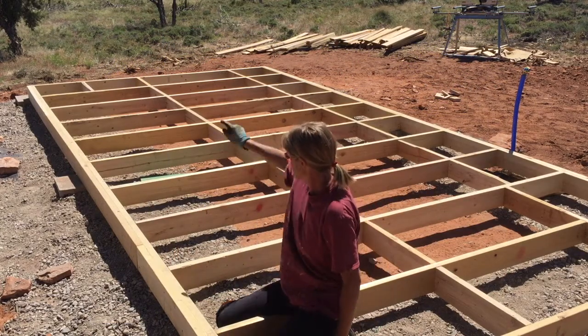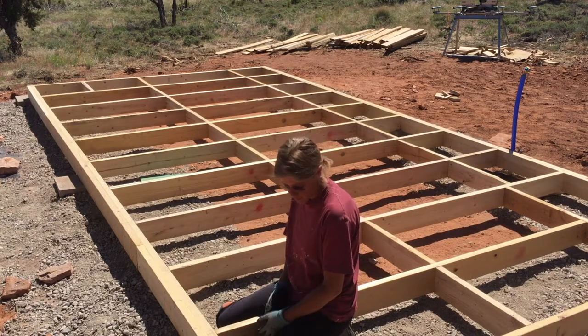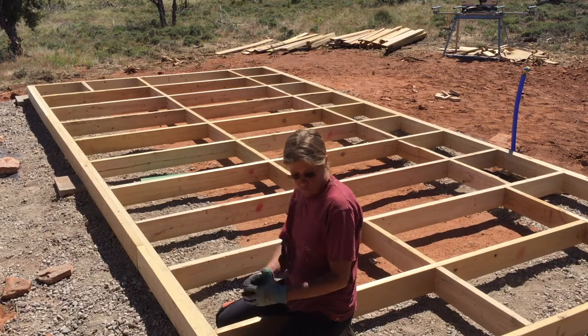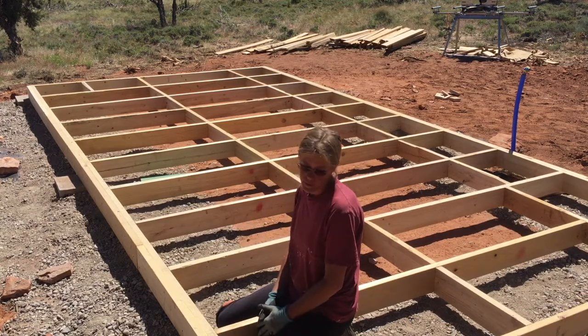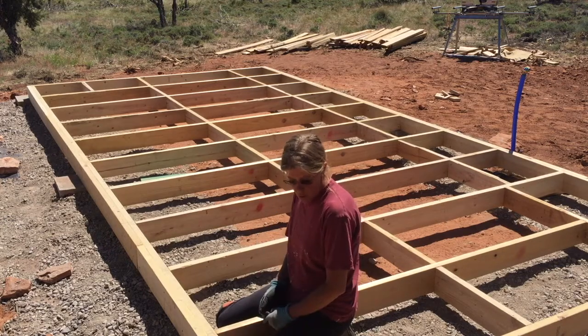Major load-bearing walls, which in this case is our north wall and our south wall, and we have three blocks, which are also our long walls. We have blocks at every 10 feet. We chose to pour these blocks in place, and we chose to send them down to rock. We could have put this movable building on a variety of different foundations. We could have dug a crawl space, we could have done footers. This is what we chose.